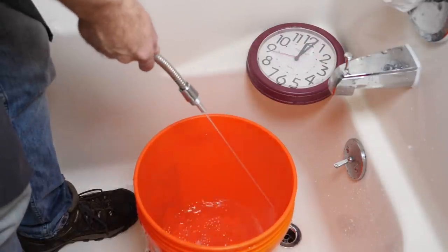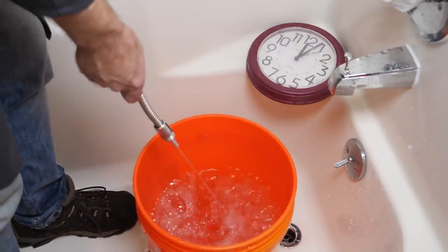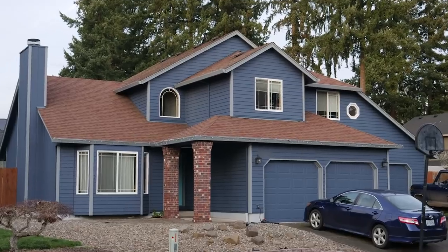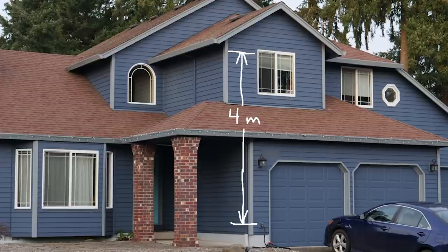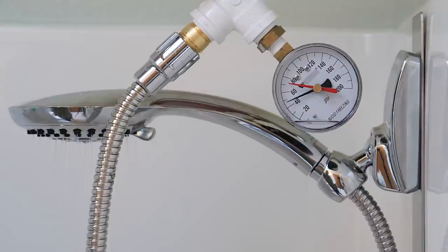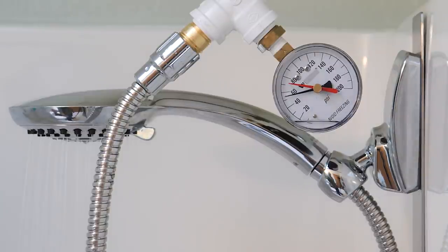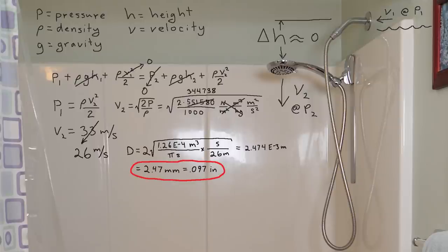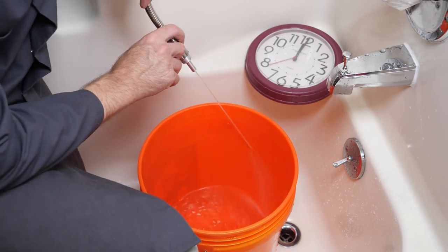When I test the water flow, it comes out way lower than expected. The math isn't wrong — the water source is probably 4 meters lower than the upstairs shower head, meaning the pressure should be about 5 psi lower, which installing a gauge in the shower verifies. And when we let water flow through the shower head, the pressure drops again due to friction since we don't truly have laminar flow. When we recalculate nozzle diameter based on this lower pressure, things come out much closer, giving us a nozzle closely matching the original shower head's flow rate — except this one could pressure wash your driveway.